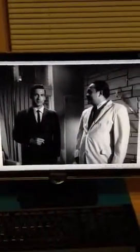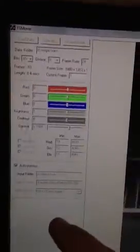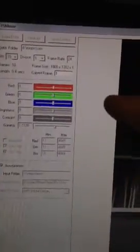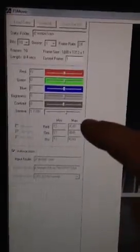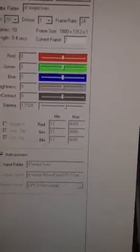That's Bloodthirst on the Waldi FilmStar scanner. There are some other controls here — basically this is streaming the data from a data folder where the scanner is writing it, picking it up, and dumping it out to disk. I've done nothing to the image straight through except apply a gamma. You can see our min and max values right at the 12-bit dynamic range.